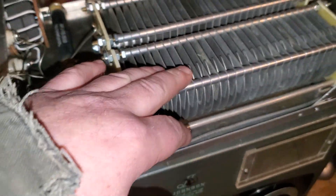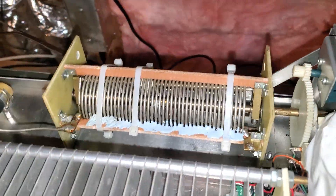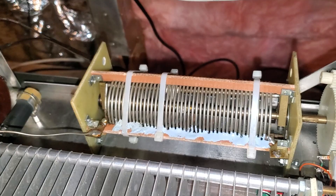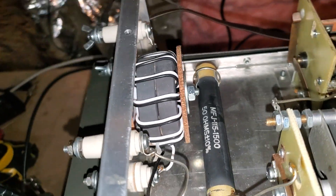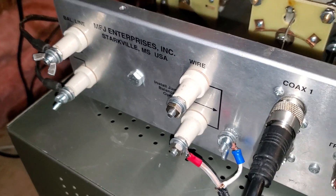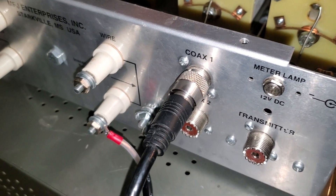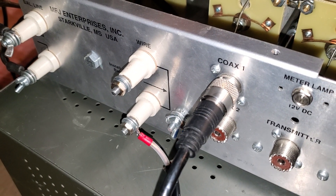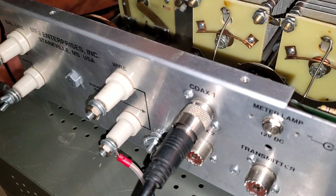These are decent, and they're a good candidate to rebuild if you can get a really old school ceramic roller inductor. But I'm just experimenting with it. This is a technique you can use to feed your ladder line and go through coax, and transform that 4 to 1 deal. Then you can still put coax in bypass mode.